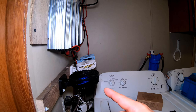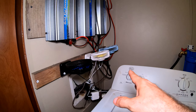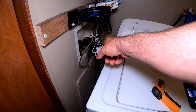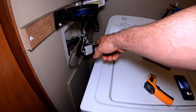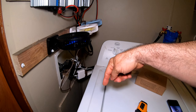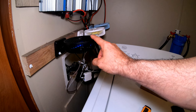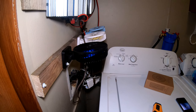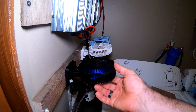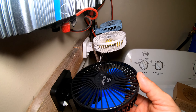This system isn't high-tech or anything special, but one important note: use multiple dedicated power bricks rather than a multi-USB strip. When you use a shared USB strip, the fans share the power and each one gets less, resulting in lower speed. With individual bricks, each fan gets the full power — that's important. I had them on a strip first and they were not blowing very hard.